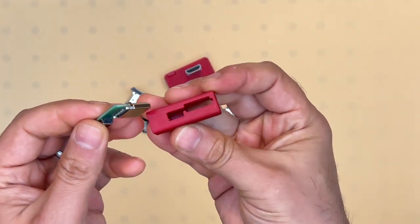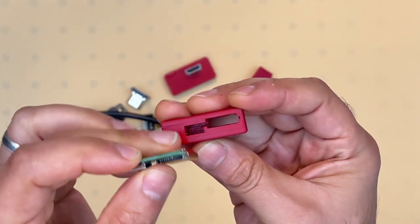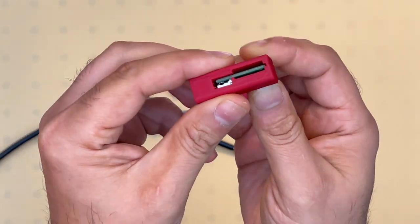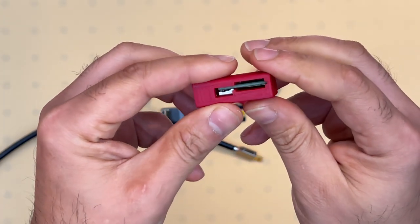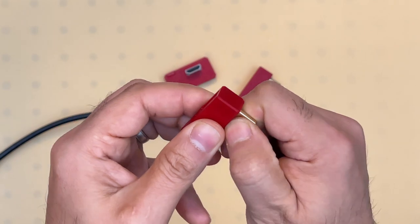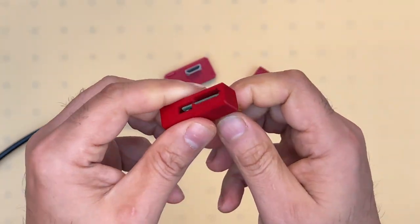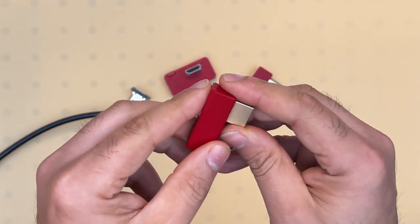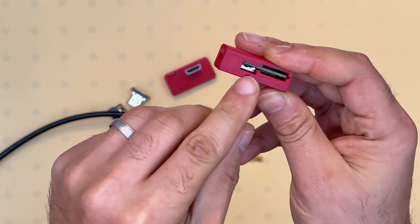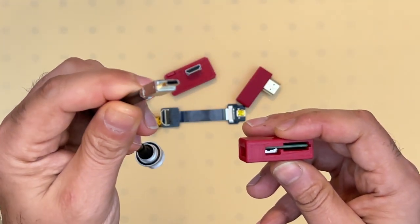To use this particular version, you have to line up the adapter to the insertion hole and insert the adapter into the stiffener. You don't want to use any sharp objects or anything that could damage the PCB board. You always want to use your fingers. Once you slide the adapter into the stiffener, you can pull it on this side using your fingers. Never use any tools to shove the adapter into the stiffener. There's a bit of wiggle room inside, which allows you to line up the micro female HDMI connector with the male micro HDMI connector at the end of the bulkhead cable.